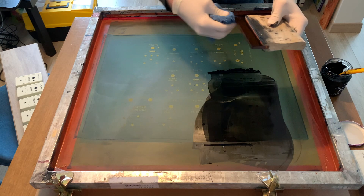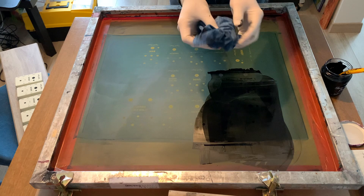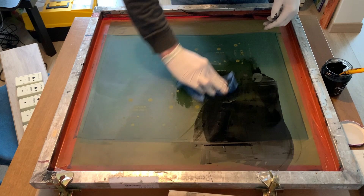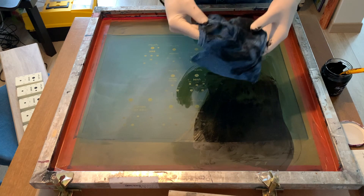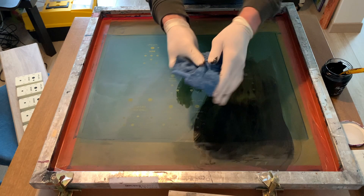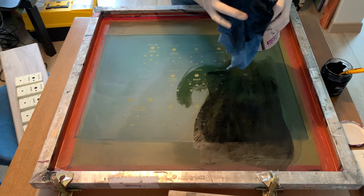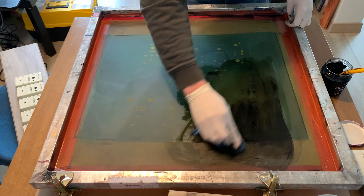If I had 50 of each to do, it wouldn't be a problem. But since this is the beginning of my operation and small scale, I'm having to do only five to ten of each model at a time. I have to clean it up and then wait for everything to evaporate, because I made the mistake of not letting the dilutant come off all the way — if you put the screen back down while it's got dilutant on it on top of a pedal, it melts the polyurethane, since it's solvent-based.